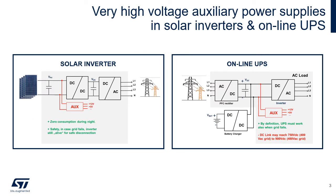The auxiliary power supply is a small but critical block in the mentioned applications. In general, the purpose of the auxiliary power supply is to provide power for the main electronics — for example, 10 to 20V for power switches and gate drivers, and 5V or 3.3V for a microcontroller.